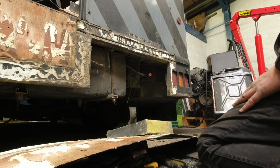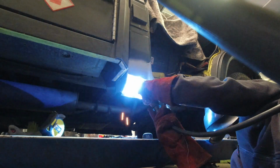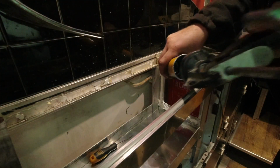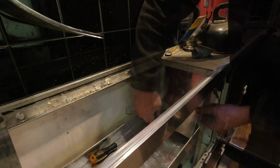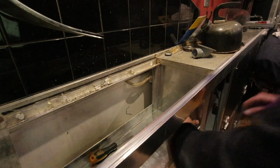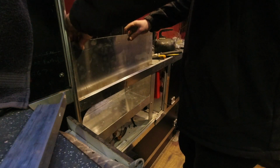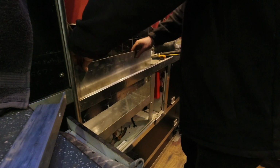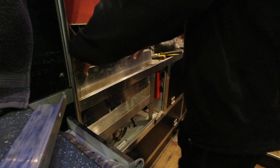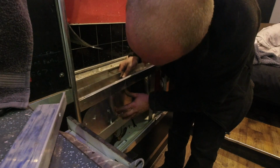Most of the next day was spent on the outside of the van. It wasn't until that evening I got back on the sink. I got the bottom in first and then cut each wall to size and slowly fit them in to try and not gouge the rest of the aluminium. I had to put enough sealant behind each panel so that it'd ooze out, doing most of the work towards creating a water seal. But on this one I went a little bit overboard, so the bottom of this one would need a bit of persuasion.